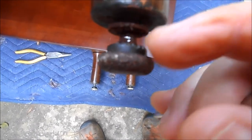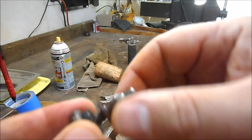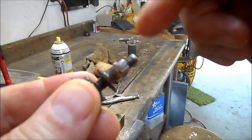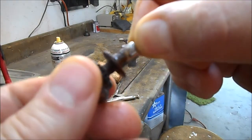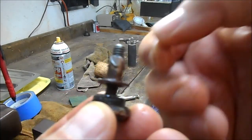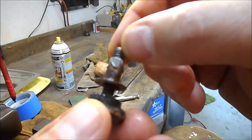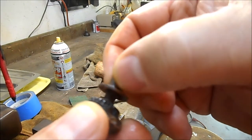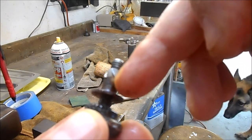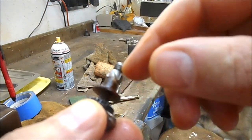I'll work this with the little vice grip wrench and get that out of there and see if we can separate these and get them cleaned up. Here's the assembly - what we need to get off is this part here; it should thread off this shaft. The problem is how do I grab this shaft when the bottom part spins loose and I can't get a good wrench in here. This end of the threads up here isn't really going to get used for adjustment, so if I can hold this part of the thread I may be able to get a wrench on this and start to turn it off. I'm going to put this in the vise, put a little bit of heat on it - if it catches fire don't get concerned, it's just penetrating oil - and see if I can spin this off.